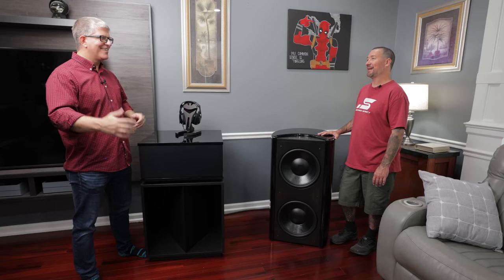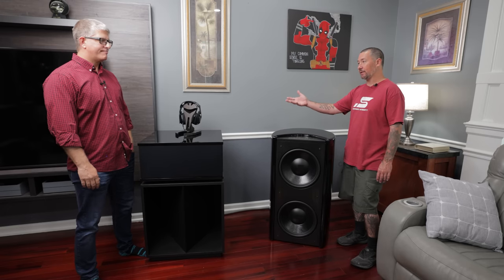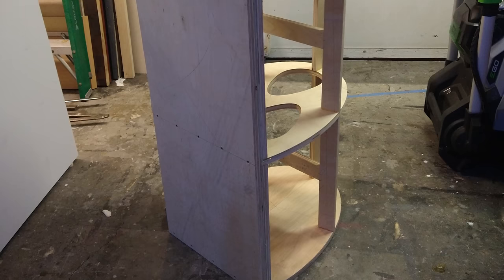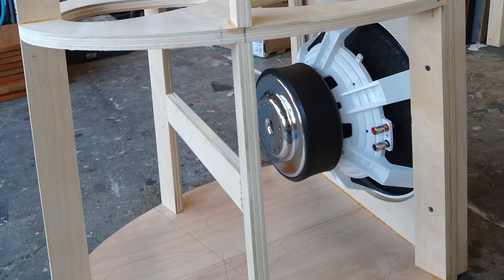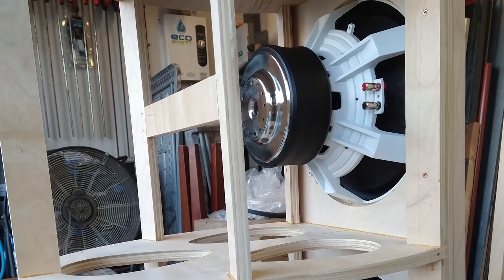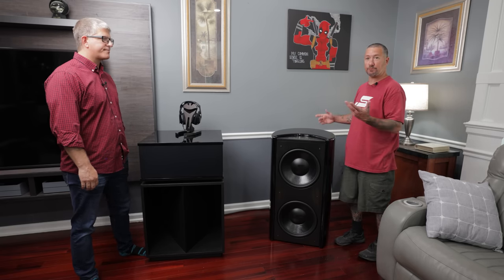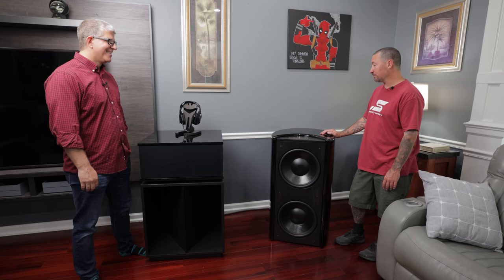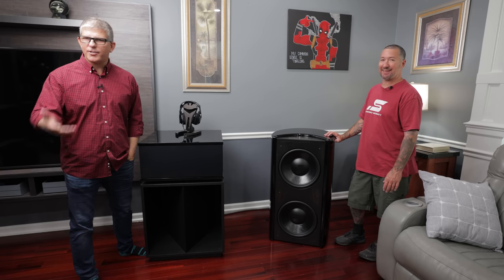This shape is actually easier to build than a rectangle. With a square cabinet you have six panels to cut; with this you only cut four panels. The walls are one and a half inches thick — you kerf it, which takes about 30 minutes and about 64 cuts per panel. Glue it up, strap it, do the second layer, fill the kerfing with epoxy. It's solid — probably about 350 pounds — but it was a very easy build.